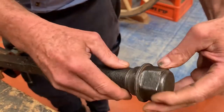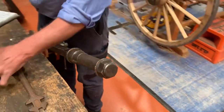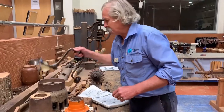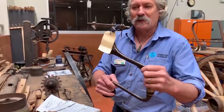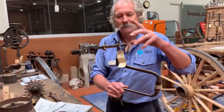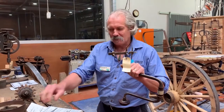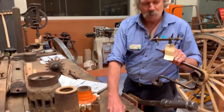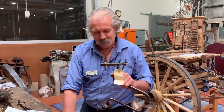To make those particular washers — larger ones like that — they were made with this tool. This is basically a trammel cutter, or a fly cutter. You can change the dimensions and it cuts a doughnut out of a flat piece of leather. That's one I've cut just as a sample. Later on there were also presses with different sizes to press them out.